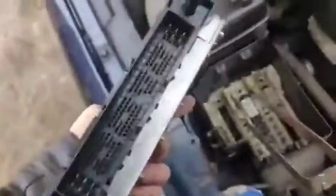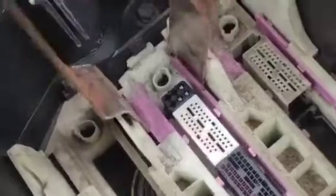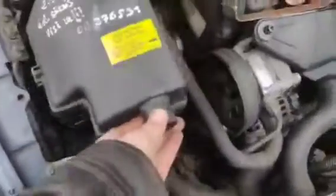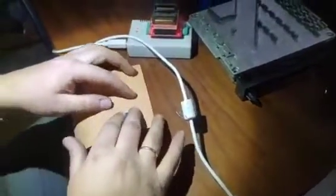It's a good engine. We already removed the ECU — you can use a homemade tool; I've made a special one and you can find the drawings on Google. Or you can just use anything that is flat to push the holders away and remove the ECU. That was the easiest part. Now we're going to go ahead and remove the flash memory.